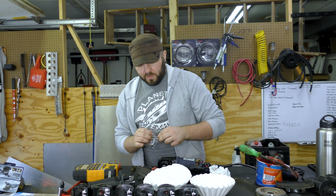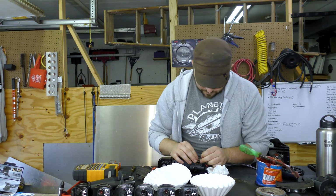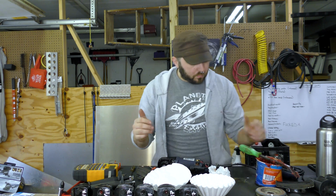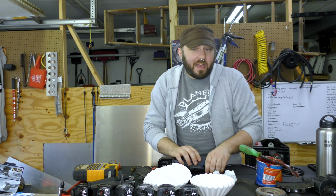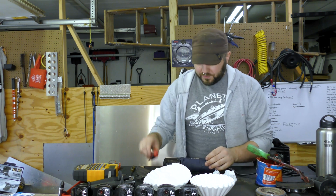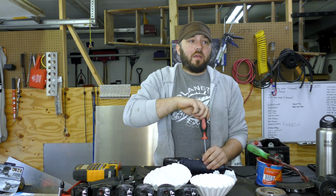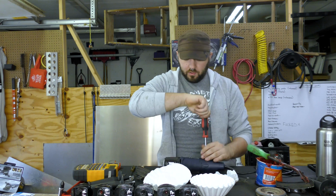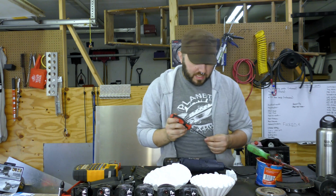And I had that problem with quite a few of these. Luckily, these Harbor Freight grinders come with a spare set of brushes, and they just slip right in. As long as you haven't taken the actual motor, the rotating assembly, out of these, they should go back together pretty easily. You have one brush on each side. These are fine. I know I have to trust a new tool, at least to some degree, even if it did come from Harbor Freight. So I'm assuming the other side is just as fine as the first side, and if it's not, I wouldn't even be able to see it. Visual inspection doesn't tell you a whole lot. I won't know until after I've run it a few times. But that's pretty much all there is to getting one of these angle grinders up to snuff 100%. And I've had some of these for as long as 5 years, and I've only had one real failure.